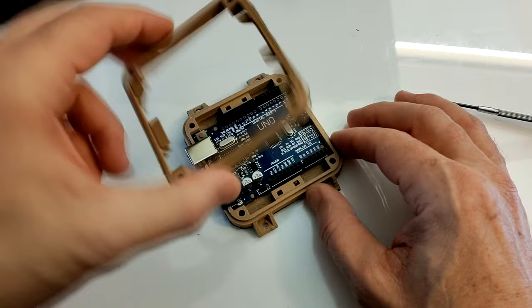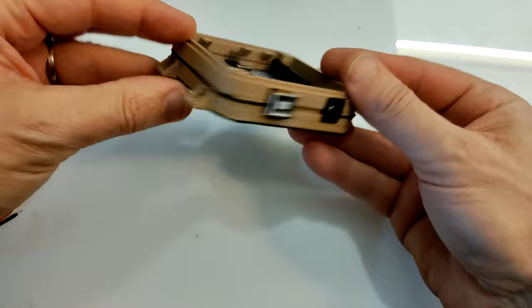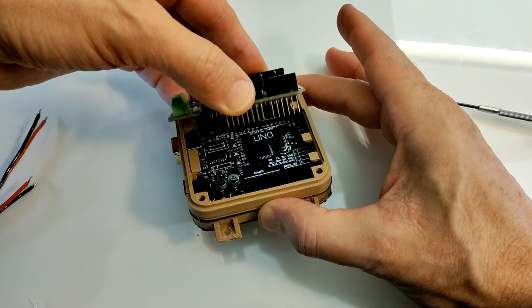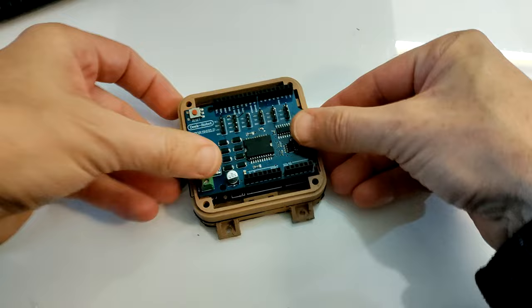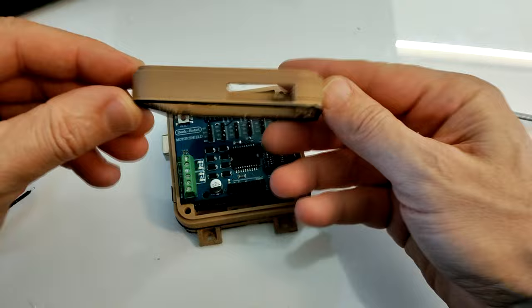Next, I put on the base frame. It fits on the top of the base, either loose or it can kind of click on, depending on the tolerances of the used 3D printer. Even if it is loose, it is held in place by the 2 mm overlapping lips. At the upper end of the frame there are supports for the PCB to sit on. My next PCB for this build will be a standard Arduino motor shield, so I install it on the Arduino headers and press it down until it sits on the support structure of the frame.